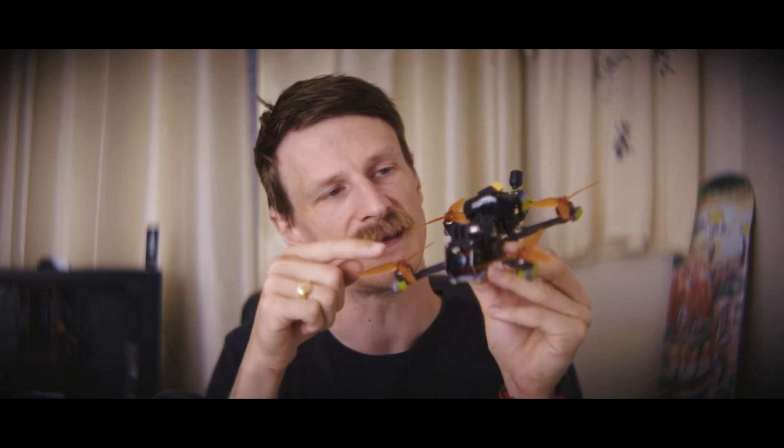In my case, I didn't have one of these and I was trying to do my Crux 35 rebuild. If you're new to the channel, I blew up my Crux 35 and frame within seconds of having it — within 24 hours — and I put it into the Fly Fish 35 Volador frame, which has been brilliant. However, the VTX is at the back and the FC/ESC is in the middle. I tried to combine them in the middle and I did it twice. The second time, something was touching — possibly causing VTX issues — and there was smoke. A learning curve for me, but thankfully nothing died.